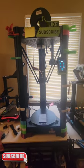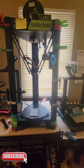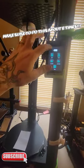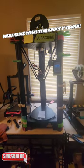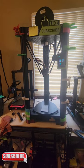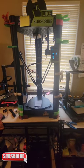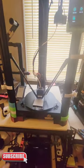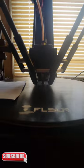I figured that out because it was never accurate — I would drop it down and pin it and then move it up slowly. I talked to a couple of different people from FL Sun and that's what they told me: make sure you always end on a downstroke because it has play in the belts and all the stuff going on in there. There it goes down — check it about three times. I dropped it back down, it's right where I put it.